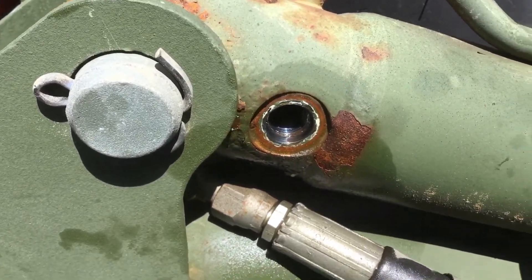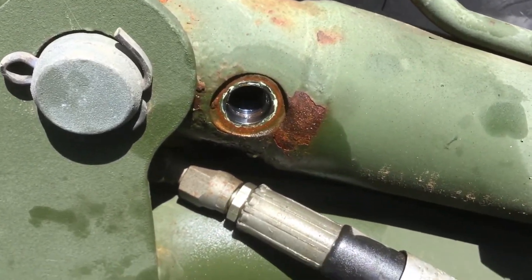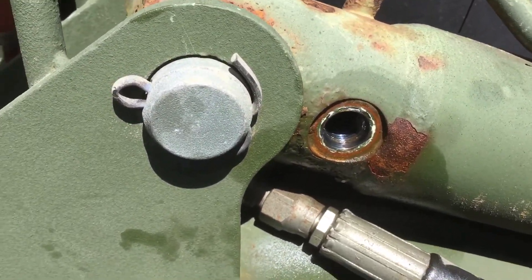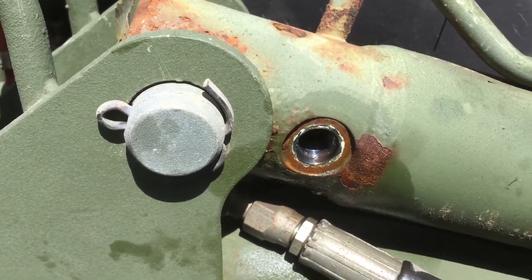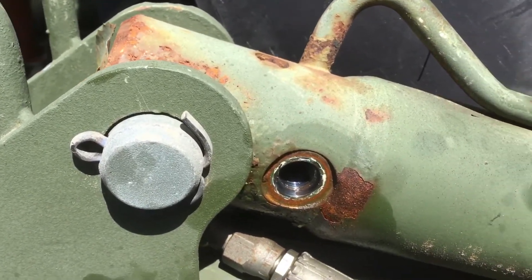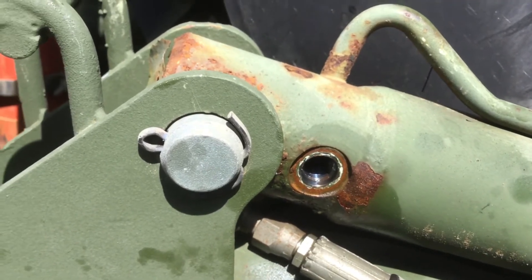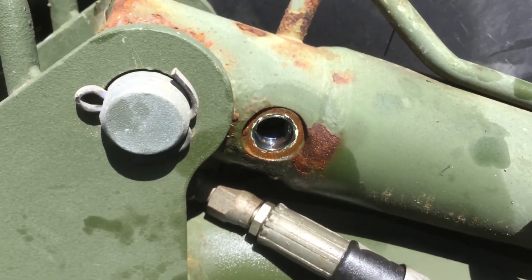The drawing shows that there is some path for leakage around behind the valve. So it should ultimately unlock itself — the springs should recenter the ball and release the lockup once you have taken all the pressures off of it, or even provided pressure the other direction. Sometimes that does not work. It might get clogged up with fine crap that ultimately collects here over the years these have been in service. Anyway, that is how you can free up the check ball.